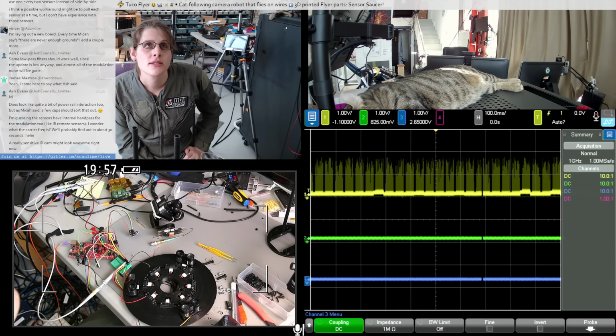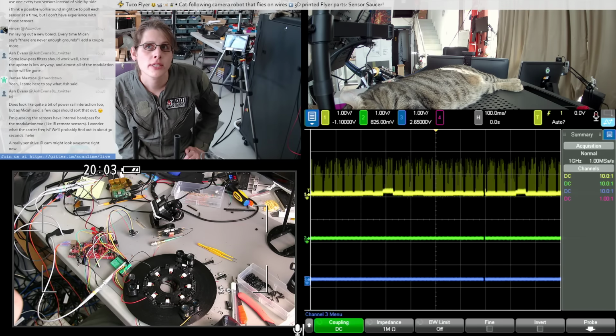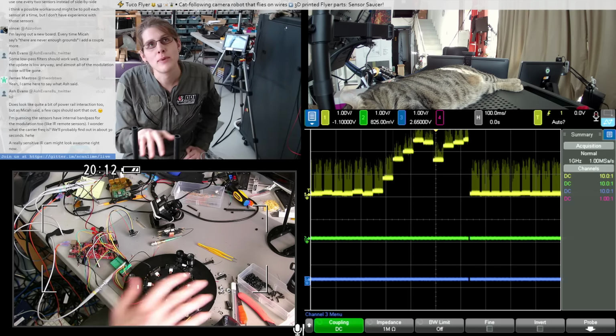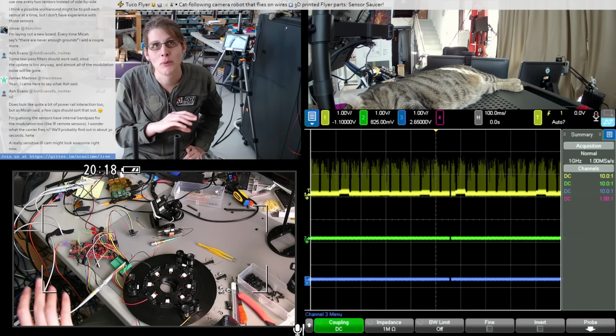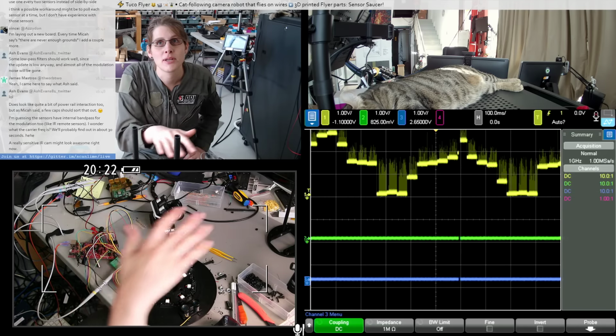So Ash was saying that some low-pass filters should work well since the update rate is low. I guess what I'm worried about partially is that I don't know if all the noise is going to cancel out. We've got a lot of modulation patterns that are all fairly similar to each other, so I think we're going to end up with interferences that have annoyingly low beat frequencies. But it's certainly possible we don't have that problem.